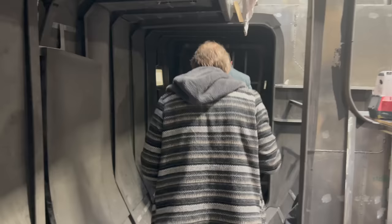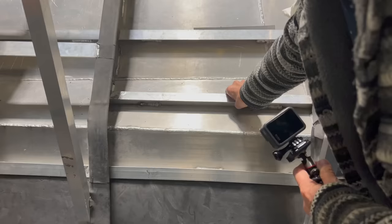Just seeing all those cross beams looks phenomenally strong, and clearly metal has that extra 17 times the strength of fiberglass. Yes, and the resistance is due to the aluminium itself, its thickness, of course, from 6 millimeters to 8, 10, 12, sometimes 14 millimeters. And the structure itself, which is also part of this rigidity.